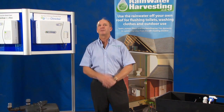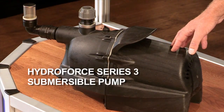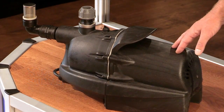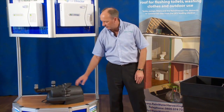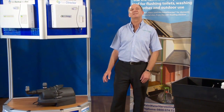We are of course talking about the RainDirector, a gravity-fed system. Firstly we have a pump, the HydroForce Series 3 pressure-sensitive submersible pump, which means it's going to sit in the bottom of your underground tank and pump on demand automatically. The pump itself will pump out at 3.5 bar pressure from its outlet point, which means it will pump 35 metres vertically before it gets to zero pressure.